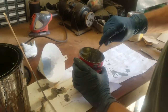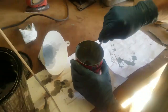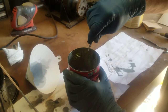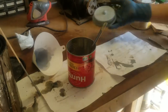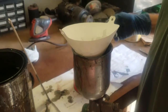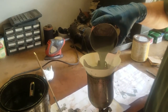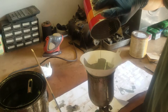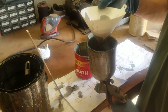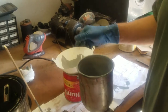We're going to mix it up really well and then strain it into the gun. I always strain it because you never know if there's some foreign body or something not quite perfect in your paint mixture that needs to be filtered out. You'll notice the outside of the gun isn't particularly clean — I don't worry about the outside, it's the inside I keep clean at all times. I always clean it after every use, and I actually store the gun with lacquer thinner in it so it's always ready to use. I empty the lacquer thinner just before use into a can and use it for cleaning up afterwards.